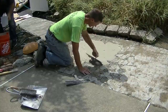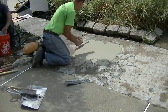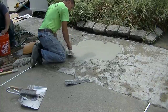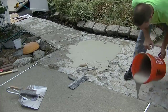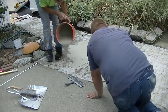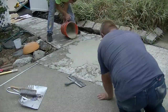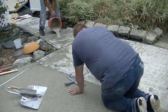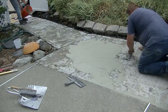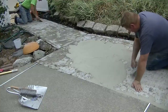You can see how nicely that stuff trowels out — you're just going to fill in all those little low areas; don't try to be too perfect, just get it close. Don't mix the whole bag at one time either — we probably only mixed half the bag at once, and we're really experienced. Half a bag at a time is enough. We got the worst areas first and now we're going around doing all the smaller areas. Once we get it dumped out, there'll be two of us troweling the stuff around and getting all the little areas filled in.